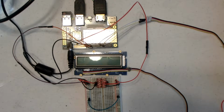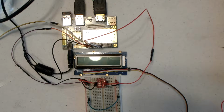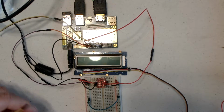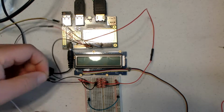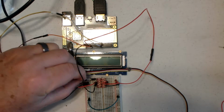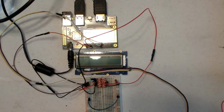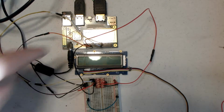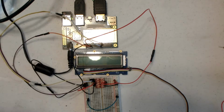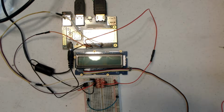Now for the purposes of this demonstration, the next thing we've got to do is bring off the I2C bus from the computer. So pins 15 and 17 are I2C bus 0, and we'll bring those directly in, and we'll take the yellow pins and go in on pin 1 of the level shifter, and we'll take pin 17 and go in on pin 2 of the level shifter. So now we're level shifting the output and input to the board on pins 15 and 17, and we bring them over and put them on the low voltage side of the level shifter.